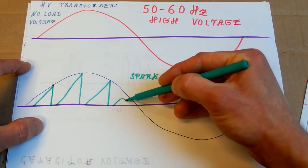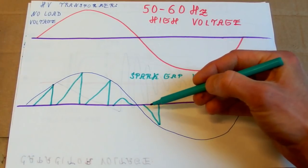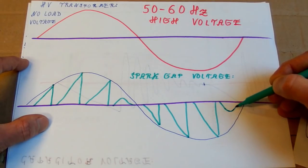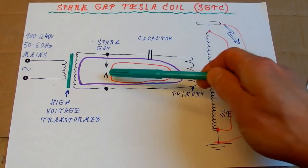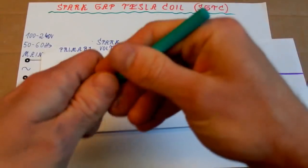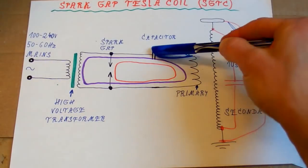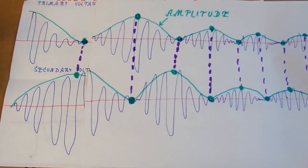At some point there is probably not enough voltage to charge it again so it does nothing. In the other half cycle it again charges the capacitor until it ignites, in the other polarity — but that doesn't matter. In each half cycle it happens maybe three times. It charges again but never reaches enough to spark, and it all repeats. It basically charges and discharges multiple times per half cycle, and the spark gap doesn't care about polarity — it can ignite in either polarity. The resonant circuitry will resonate no matter the initial polarity; it can start from positive or from negative. The initial polarity of the voltage on the capacitor doesn't really matter.